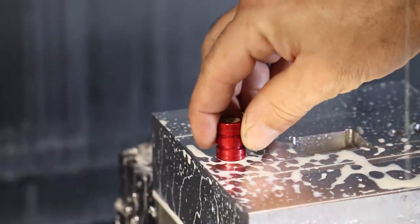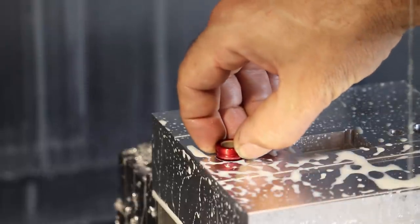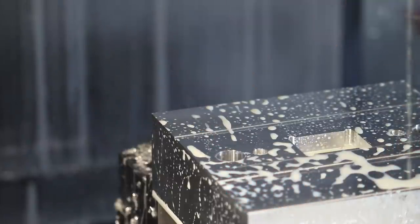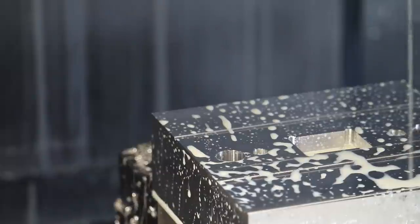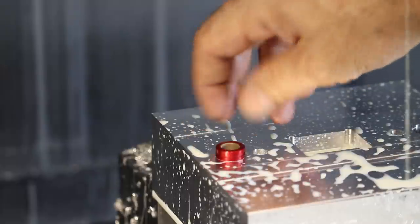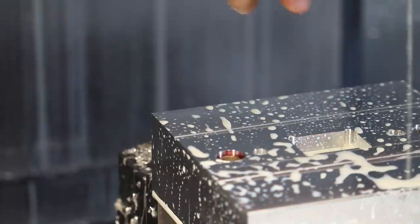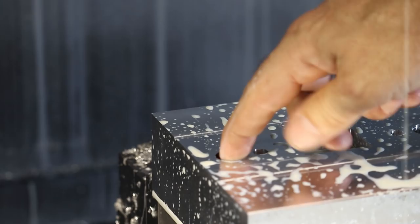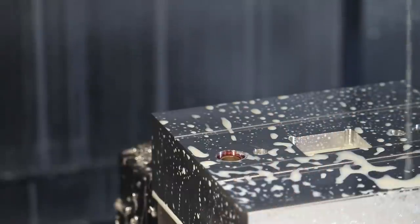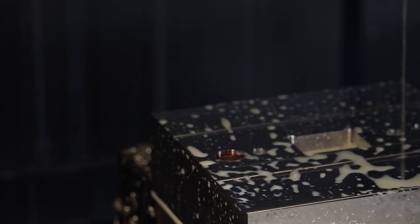So what we're looking for is a light press fit, and this actually is dropping right in there. Yeah, that's okay. And this guy, but it'll probably tighten up at the bottom. I added 10 microns to the radius, but I guess this end mill was ground a little big. So, all right, well, it's starting to tighten up at the base, and I made the hole deeper, so I think once I, basically with flexure in cutting, the bottom of your CNC milled hole is usually a smaller diameter than the top. So we have an extremely slight taper in that hole.